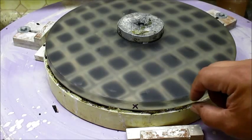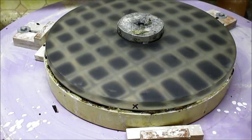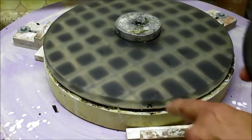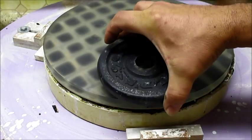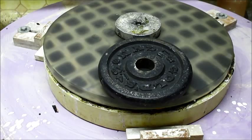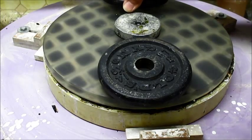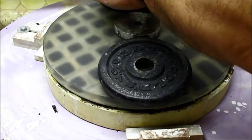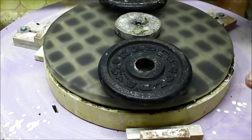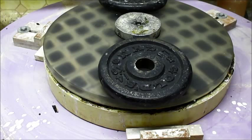This blank is pretty thin — 0.7 inches edge thickness — and even though it looks like a good sphere, it's very common to have astigmatism. What I'm going to do is put some weights with double-sided tape on this axis out here on the edge. This will cause additional pressure here and on the opposite side. The idea is the mirror will flex more, pushing the high spots lower, which will polish out. Hopefully this speeds up removing the astigmatism, because it takes a long time to polish it out just by machine.